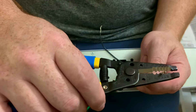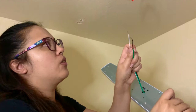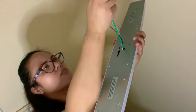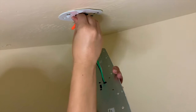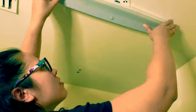This part is currently stripping the wires. So here we have a white wire, a black wire, and the green wire, which is our ground wire. Now we're going to connect the black to the black and the white to the white. Next, we are going to fix the wires and put them back inside the junction box. Now I'm going to put the covers on.